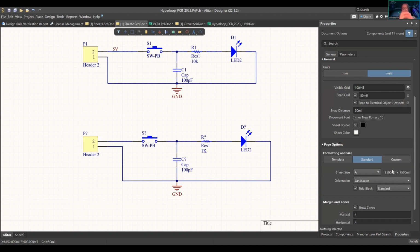An assembled board means the PCB designer gives the CAD drawings to both of them, but what essentially happens first is that it moves to the fabricator. Now I just have this green slab, but I need components on the board. So the fabricator will push it over to assembly, and then we'll run it through an SMT line, or whatever way you're going to assemble the board. You can assemble it yourself. There's manual assembly, and automatic assembly, which is a different conversation. Then we go to the assembly house. So there's a fab house and an assembly house. Sometimes they're together. It depends. So that's that.